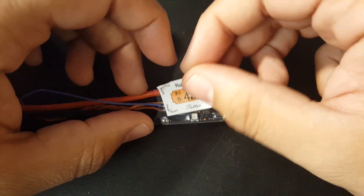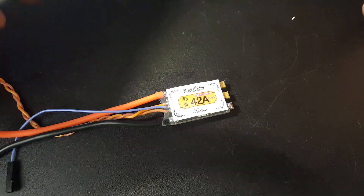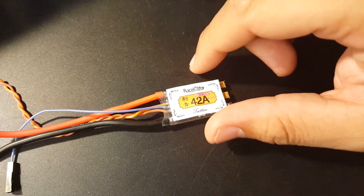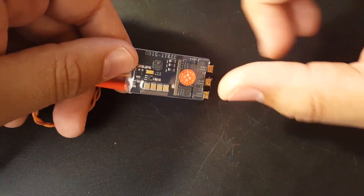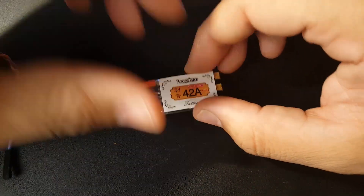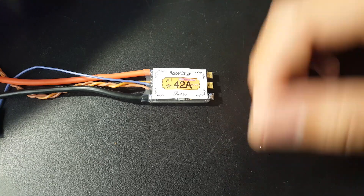How did this one do? In terms of noise and phase holding, it did basically perfect. The default average voltage spike was 20 volts and the average voltage drop was around 14 volts — which still qualifies as a very good ESC. I did get a comment from someone who burned one after a couple of days, but I can't confirm that until real-world testing, which I'm planning to do soon — potentially on 5S, full throttle.